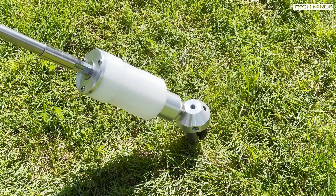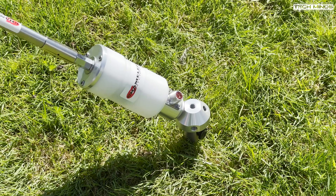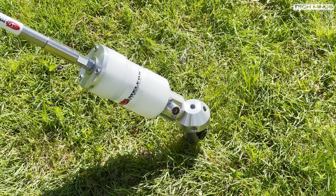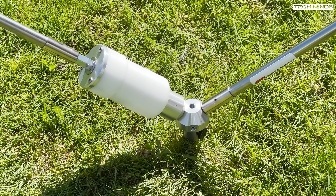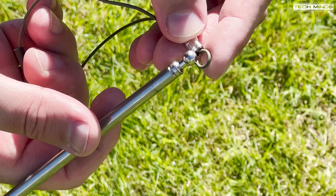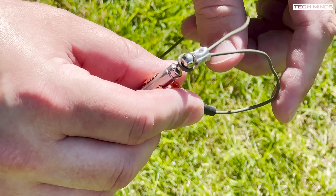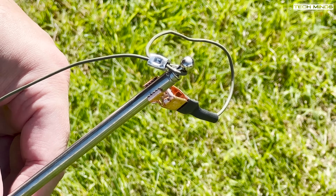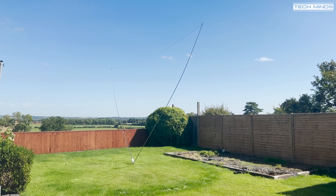I'll attach the bottom of the matching transformer to one of the V-coupler's threaded holes — these also fit together very well. The order in which you attach all of these items is really up to you; I just found it easier to do it this way. After attaching the other telescopic antenna to the other side of the V-coupler, it was time to attach the element wire between the two tips of each telescopic antenna. You'll notice a little tension loop near the spring-loaded connector — I just place this over the little ball at the end and then attach the spring-loaded clips towards the top. The other end of the wire is attached exactly the same way.